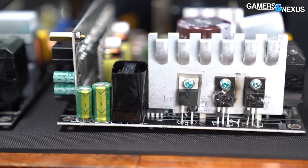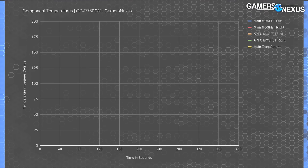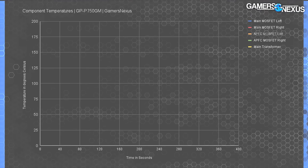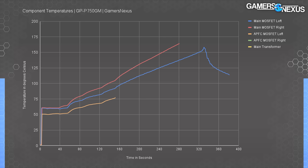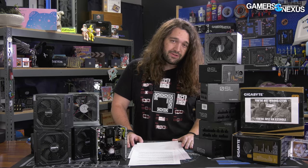After sharing these findings with Aris and other professionals in the PSU space, we began to lean more toward manufacturing or design as the likely cause of failure. We rigged up thermocouples to unit number 9 for more testing. Interestingly, it popped the same FET as the previous one, and the two power supplies had sequential serial numbers — 2396 and 2397. The MOSFETs are rated for operation up to 150 degrees Celsius, and the point of failure we reached with a thermocouple probe was 195 degrees Celsius. Over-temperature protection should have kicked in and shut the unit down. At this point we had seen enough to validate Aris's testing, but needed to put a cap on our own time investment — this had been dragging on for months. We would not be comfortable using these at this point.